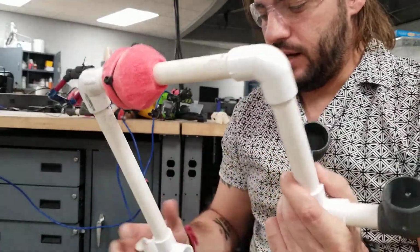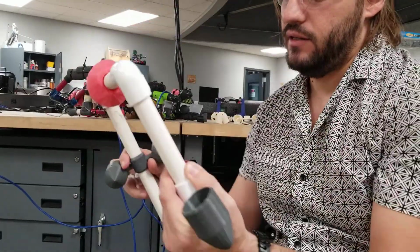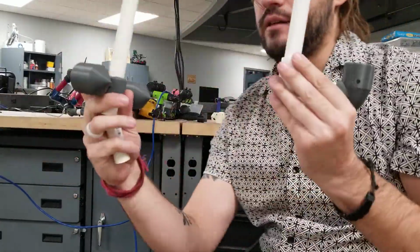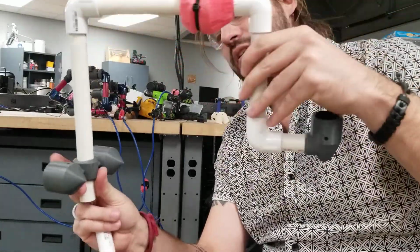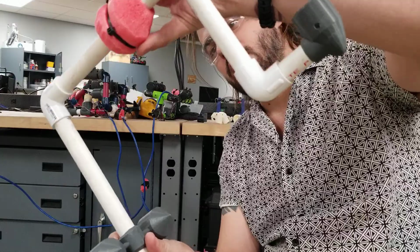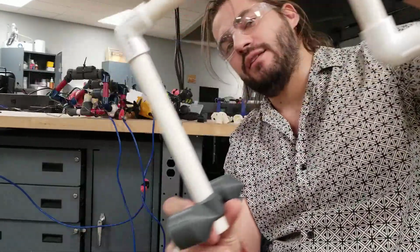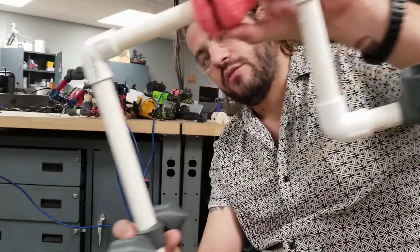Let's say you've got your 2 motors in the back, and they're way down low like this. What's going to happen is when these motors push, they're going to push up like this, and then this buoyancy is going to try to correct. It's going to find this equilibrium of going like this, and it won't flow straight through the water.